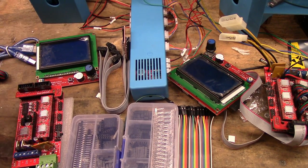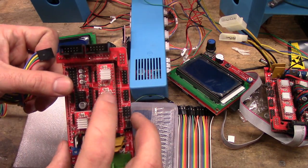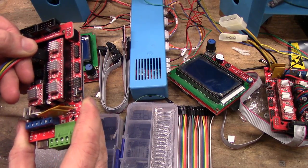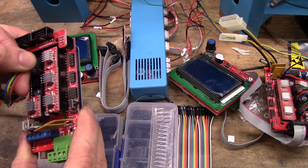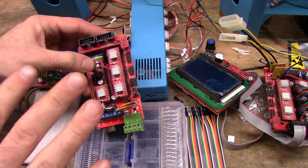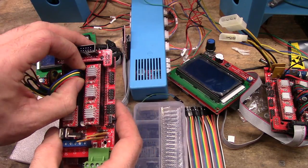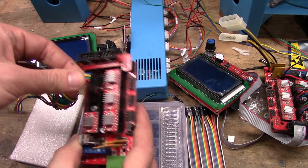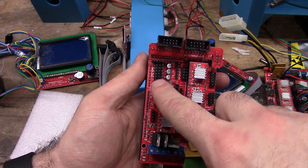So once you get pre-terminated, you just plug them in to the three spots for X, Y, Z, and then you'll have one for your extruder. Just plug them in. It doesn't matter which way they go, they just go on the four pins. And the Z will have two sets of four pins. Just pick one. Doesn't matter. They're in parallel. And I'll explain why the order doesn't matter right now when you first plug them in in the next video, when I go through the Marlin settings and stuff. Because you won't know for sure which order it is in most cases, or if you're smarter than me, you might, but I just guess and check, as it's easier for me. So that's the steppers.